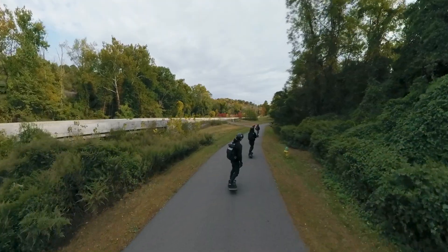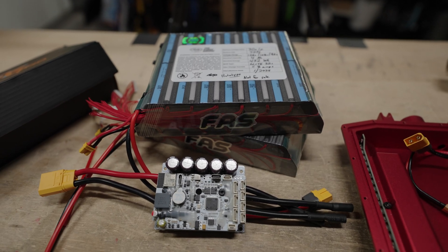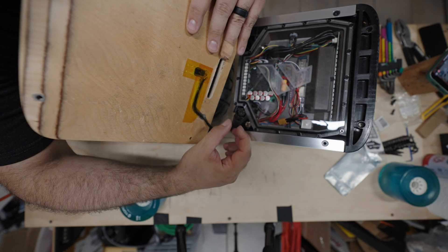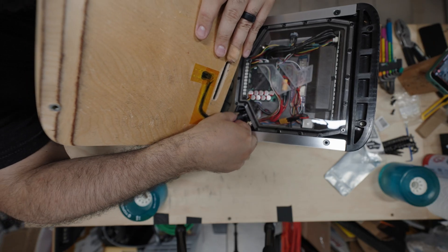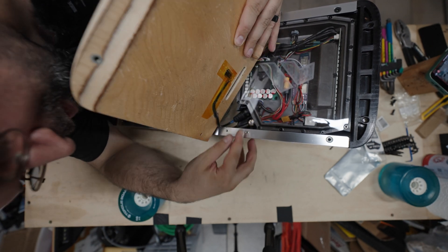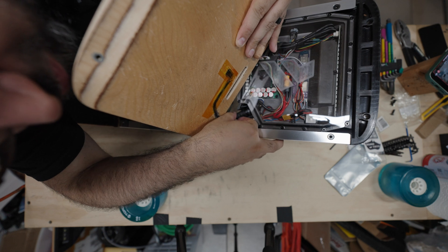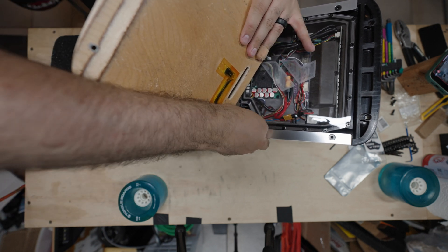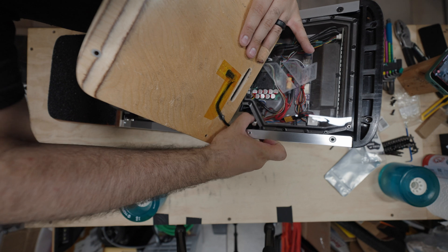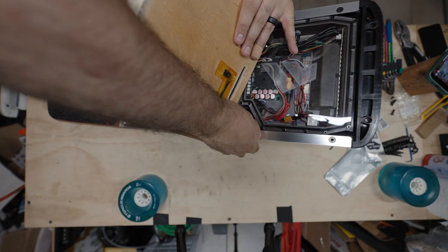Hopefully the Thor 400 has addressed that. I have one here for the upcoming 126-volt fast pack, but I haven't built with it yet, so I don't know. The front sensor pad connector is something I would also change. The plug here is an actual Switchcraft brand connector for that standard XR-style bayonet, where it usually has a generic-style connector. The Switchcraft I used is really tight fitting and it really sucks to remove. Next time, I will just use the same generic one that has always been used, and I'll stop trying to do things better.